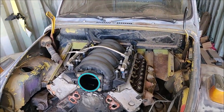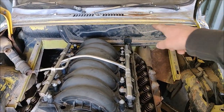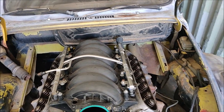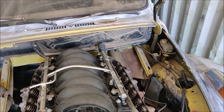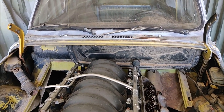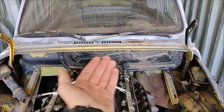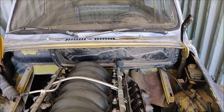I've got my throttle assembly and throttle cable that I need to put on. I need to get the trans mounted so I can pull the engine out and finish up my firewall, and then start mounting my pedal assemblies. After I pull the engine out, I'm going to remove all of this fresh air fan stuff underneath the dash — it has a lot of wiring I'm going to be pulling out anyway. I'll take this cover off, cut everything off there and clear it back.